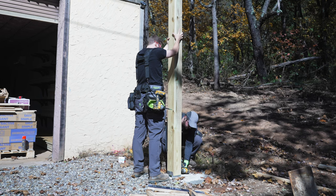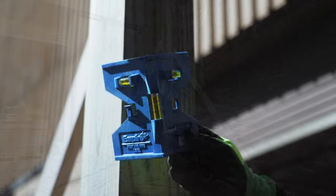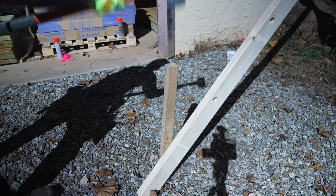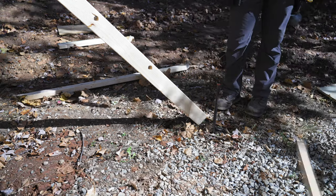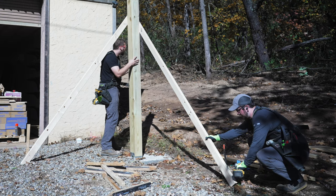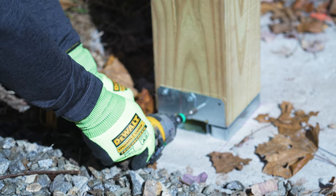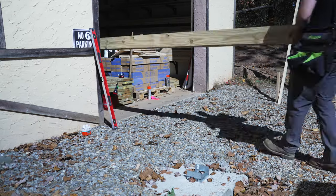These posts were super heavy and I didn't want them falling over on us, so I added one screw through the bracket to hold the bottom in place and then added two two-by-fours as diagonal bracing to keep the posts upright. I used a post level to get the posts mostly plumb so I could locate my stakes to secure the diagonal bracing. My first stake went in easy enough but the second stake was getting mangled since the ground was so hard, so I pulled the jet sticks from the string lines and used them for the bracing — they worked great. With the stakes set, I got the post plumbed on two sides using a four-foot level for more accuracy, then secured the diagonal bracing to lock everything in place. I also added the rest of the screws to attach the bottom of the post to the post base brackets — Simpson calls for one-and-a-half inch structural screws for this specific post base style.